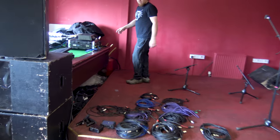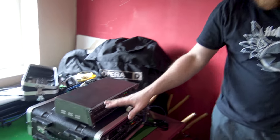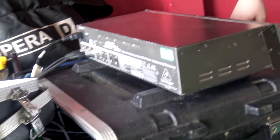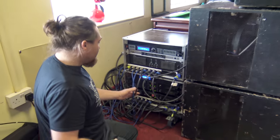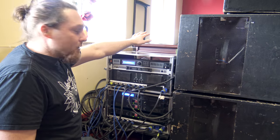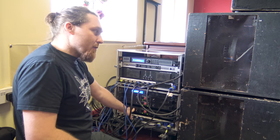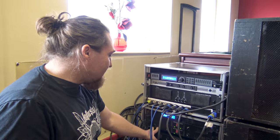The inputs you see here are on stage - all the microphones will go in here and then via this Cat 5 they'll transfer to the mixing desk. The outputs go to the amplifier racks. Down here we've got the amplifiers for the front of house speakers - these are PKN, touring-grade amplifiers, Hungarian-made, very good and very expensive. From the converters it goes to this unit up here which splits the signal to its different bands - this amplifier runs the subs with a cutoff point around 150 Hz.